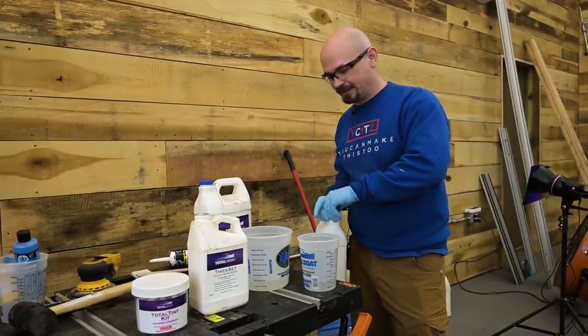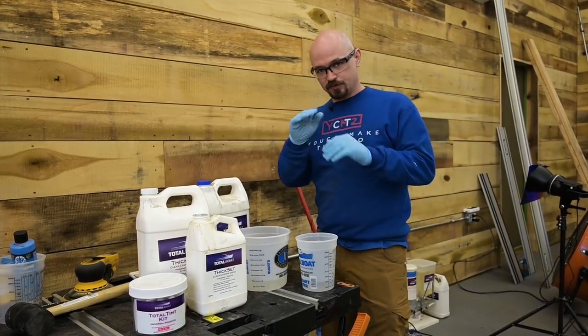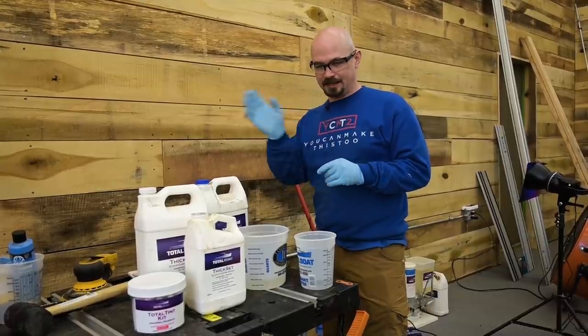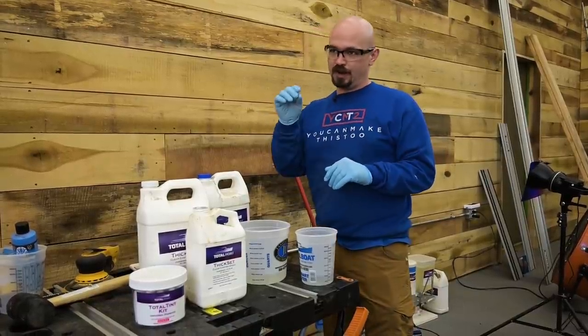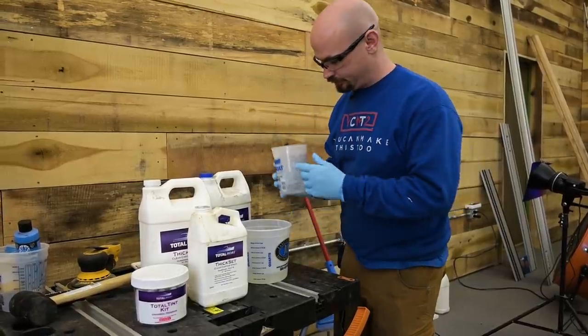We taped the underside of the table to keep the epoxy inside. On the ends, I've learned that tape doesn't hold worth anything, so that's where we used some caulk and caulked that in — that'll hold it. I even just smeared some. That's not a big deal because this hasn't been flush cut yet. All that's going to get trimmed up. I'd rather do the messy work before everything gets trimmed, and then we'll have nice clean edges.